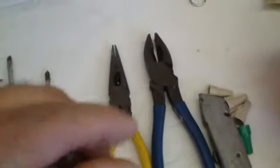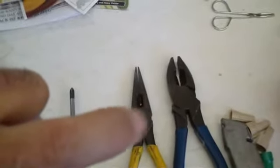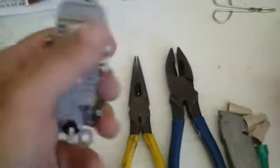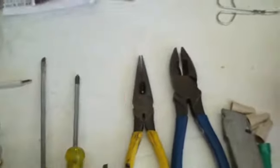And the reason is, all that is in there is a tiny little tab, maybe about that wide, if that. And when you push that wire in there, it just touches against that tab. It spring loads against it. Over time, those tabs do loosen up, and they cause problems, especially when outlets are used as pass-throughs. You have the power coming in and it feeds onto the circuit. There's another little technique I use that leaves the outlet out of that loop, which I hope to cover, because I don't know what's in some of these electrical boxes.